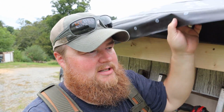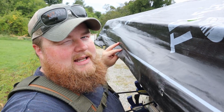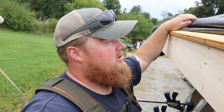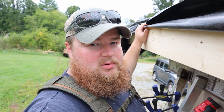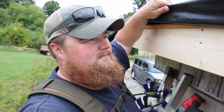All framed up. Got our subfascia board up there, and it is buttoned down super solid, nice and tight, just right. I went ahead and left the overhang down there beyond my hand. Left it farther than I know the roof is going to be cut off at. I still got to trim the ends of the house, so there's enough down there, and it is attached to the plywood, so it's not going anywhere. Otherwise, this looks really, really good.